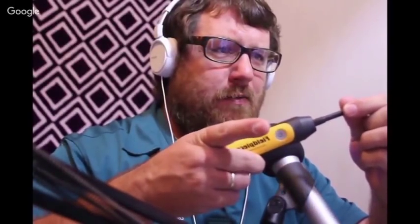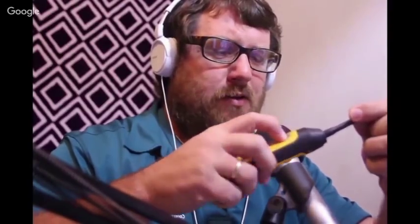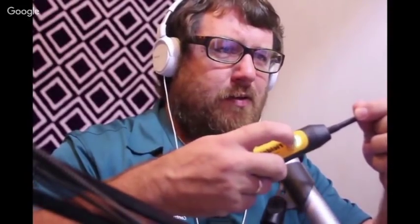There's a little button to turn it on — hold it in and you can see it starts to flash, then turn it off and it flashes quickly and turns off. Pretty simple. There are two of those, so you can get your supply temperature and your return temperature, which is pretty cool because this thing will do some calculations for you and you'll have all the information you need to troubleshoot your HVAC system.